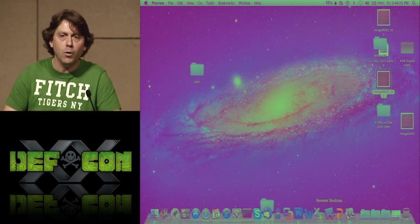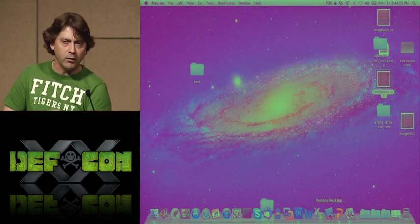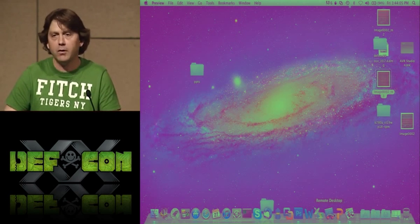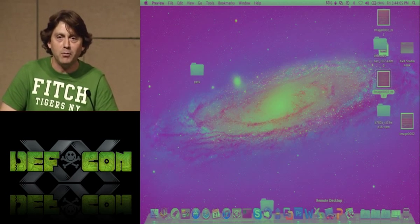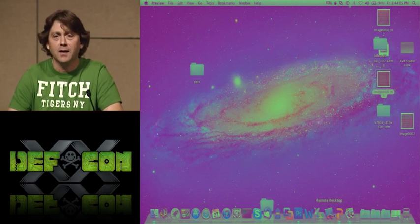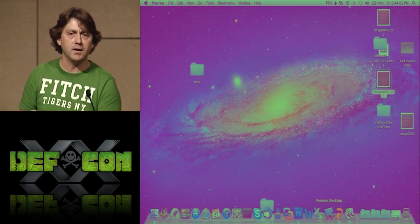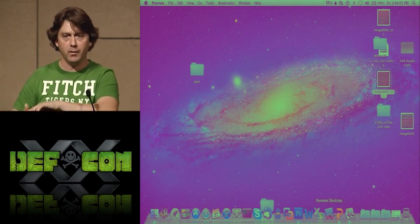It's even worse on their 90 nanometer stuff. They have a 1 micrometer spacing on their new stuff between mesh tracks, which is absurd. I mean, I love milling 0.4 by 0.4 holes, and that's large. So 1 micron spacing is sad. But remember, the fingers, I can turn off the finger and it's dead metal, and then I can actually use it as a conductor if I wanted to, or I can mill it completely away.